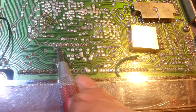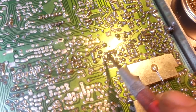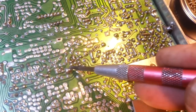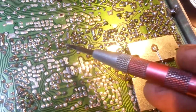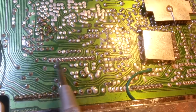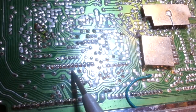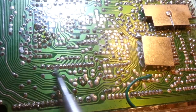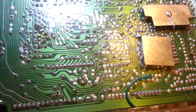After cleaning, you can inspect your work — how do you inspect solder joints through a bunch of glopped-up goop? You can't. There's a little solder ball right there that we don't want — that can break loose, bounce around, and short between terminals. Really sloppy soldering. You should have nice shiny good-looking solder joints when you're done. It should look like a little pyramid, just like the factory ones — that's the whole idea. There are some tips on re-soldering old oxidized solder joints.